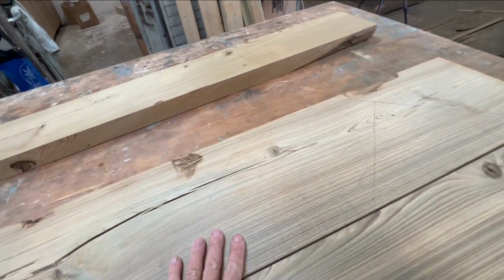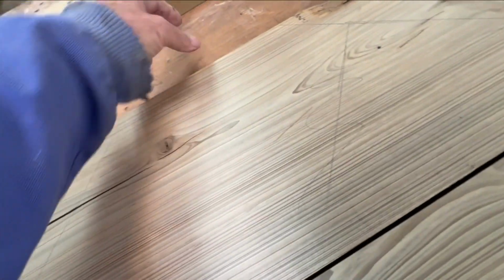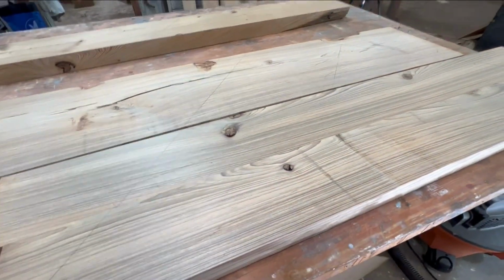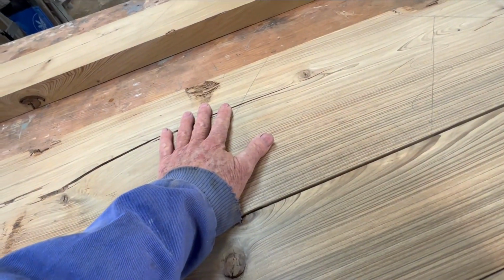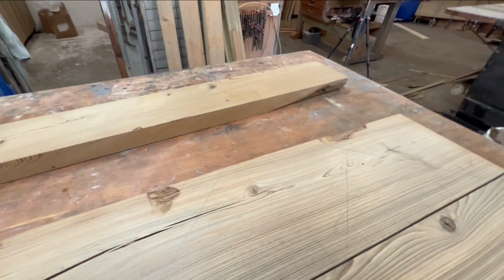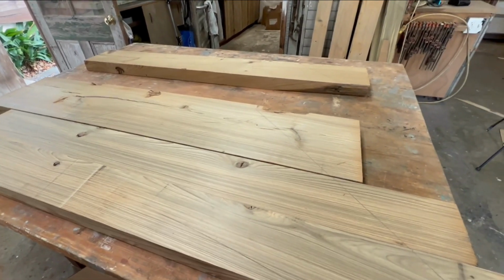They didn't have this green color. So what I'm thinking to do is cut this, and hopefully this piece could go up there, and there won't be enough left to really matter. But these 3, they have good color match. So that's what we're going to do. We're going to put them on the table saw and resaw them to an inch, and I'll have to bust this one in half, cut it to an inch, and then play with these scraps, and hopefully I can use some scraps over there so I don't have a color difference. I don't think it'll make that much difference on the door faces and the drawer faces, but on the top I kind of want them all the same.